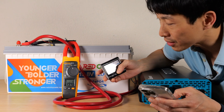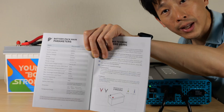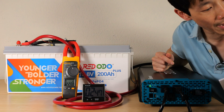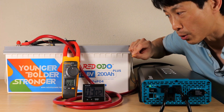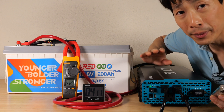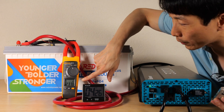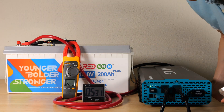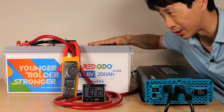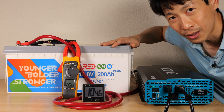But if we go a little bit beyond that — we're at 217 amps, about 10% over. It can do 400 amps of discharge for five seconds, so if it's significantly lower it will last a bit longer than that. It appears it's not measuring the amperage that's going over; rather, it's probably waiting for something to heat up too much and then cut itself off. After four minutes it still hasn't cut off. So I'm going to increase the load a little more to 3000 watts, the limit of my inverter. Now we're reaching 233 amps — it's been 10 minutes already.